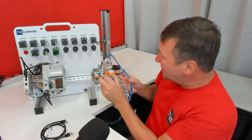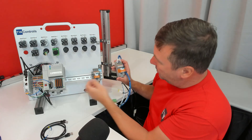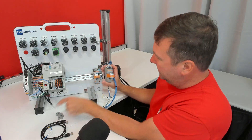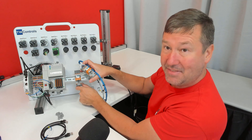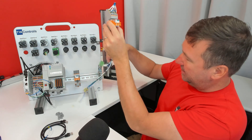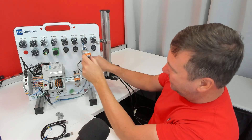This relay goes in place of the relay that comes on our standard trainer. We're going to pop the end cap loose and set it aside. Slide that relay over and put this relay in place of it. Before you do that, it's easier to go ahead and tuck this harness in because it's going to go behind the DIN rail.